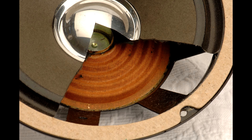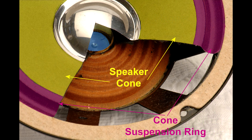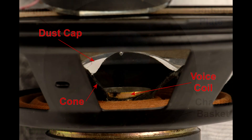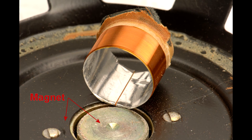Sometimes it is interesting to see the construction of a loudspeaker, so I have added photographs from an old speaker I previously dissected a few years ago. Hopefully this gives some insight into the different parts that make up a basic speaker. Here is my cut-away: you can see the voice coil and the suspension, dust cap and the magnet, the speaker cone and the cone suspension ring, the bottom plate, the terminals and the chassis. And here is a close-up showing the voice coil, and the voice coil removed from the magnet.